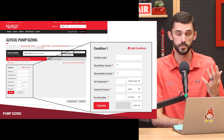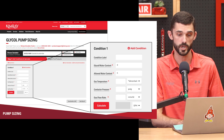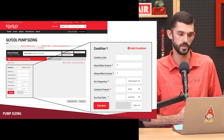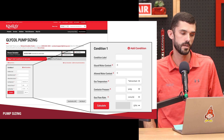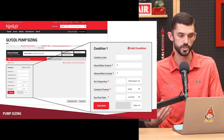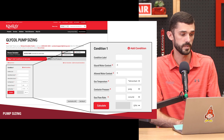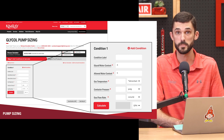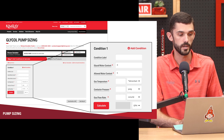A few things that you need to have available, either if you're going to have us size it for you or if you're going to try to use our sizing calculator: you'll need the pressure in the contact tower and the allowable water content — that's in pounds of water per million cubic feet. A typical allowable water content is seven pounds of liquid for every million cubic feet. The less water you have, the drier your gas is — it could get down to maybe five pounds of water per million cubic feet. Our calculator starts you out at five pounds of liquid per million cubic feet, but you can adjust that. It also auto-populates the glycol-to-water content, which means you need three gallons of glycol circulated to remove one pound of water.